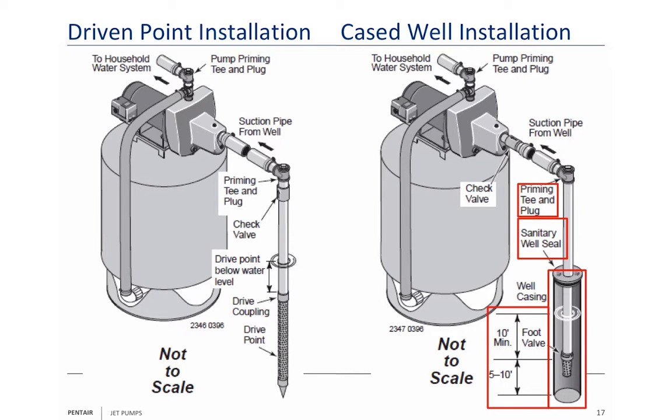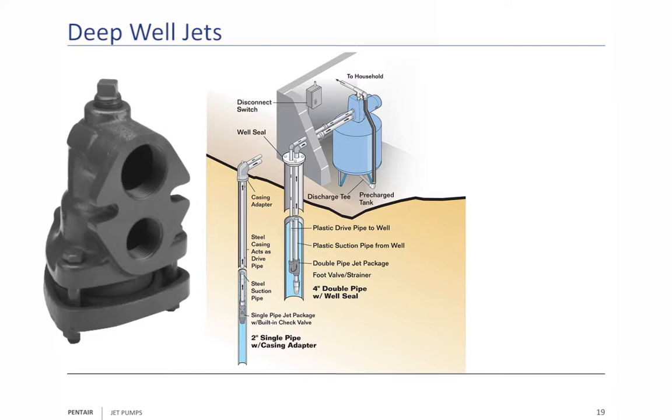With the foot valve in the drilled well, you're going to prime that whole pipe. This pump is going to prime so much easier than the driven point pump because you don't have all that air to evacuate. There will be some bubbles because air clings to the side of a pipe as you fill it with water, just like it does a glass sometimes. But once you knock those bubbles off, you're going.